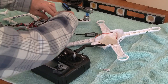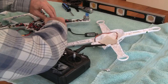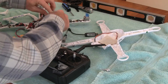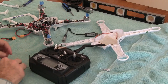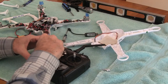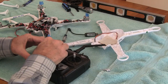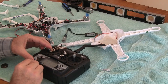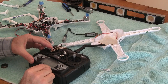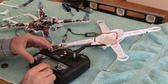Go ahead and do the last ESC, number 1 — should be the upper right or upper left corner. ESC number 1 is plugged in. Plug the battery in, give the extra beep, hold the coins there — we're at 4%. Did the extra beep. It starts at 11%, 12%. So they're all starting at about 12–13%, as they should.